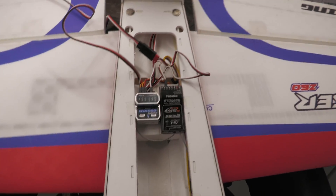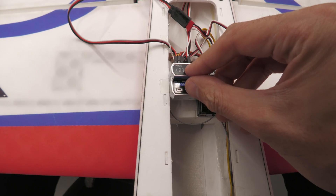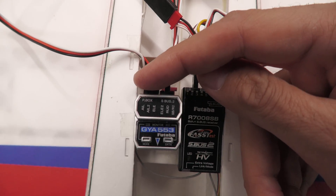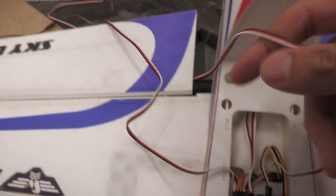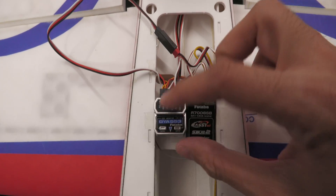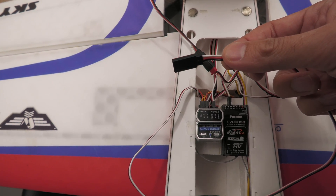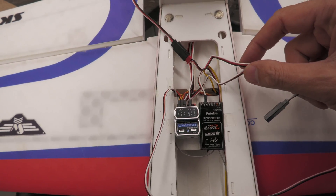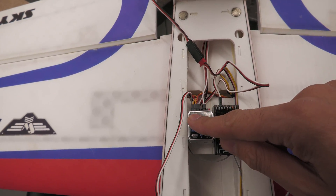Let me show you how I've connected the gyro to the adapter — I've had to pull it out completely. On the back of the gyro we've got the SBUS2 port and the P-Box port. For the SBUS2, I've left the cable in there, disconnected it from the receiver, and that's now going via a long lead all the way back to the computer into the adapter. On the P-Box port I'm going to connect another long lead into a battery pack.